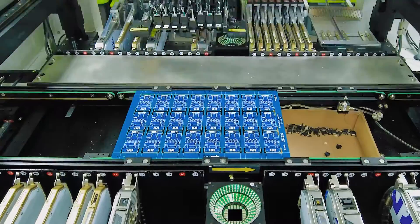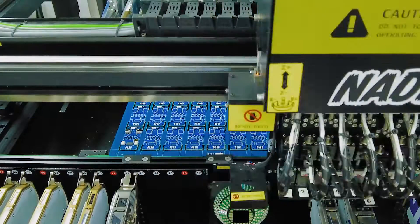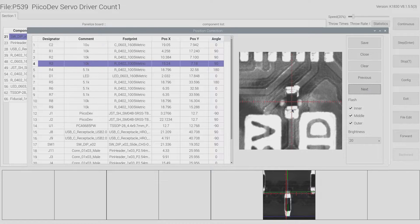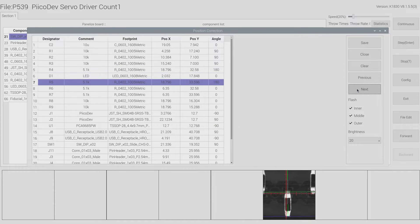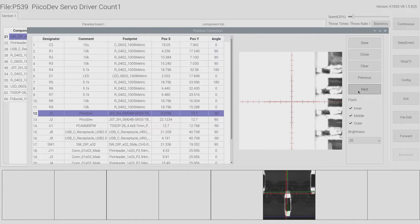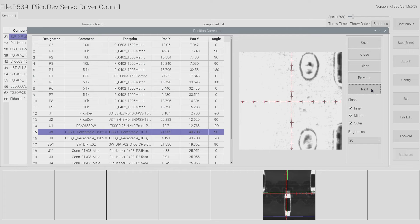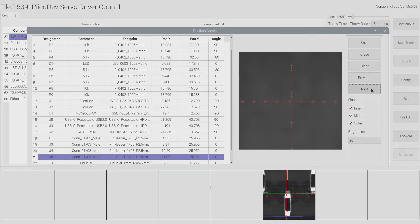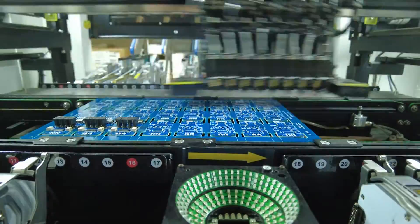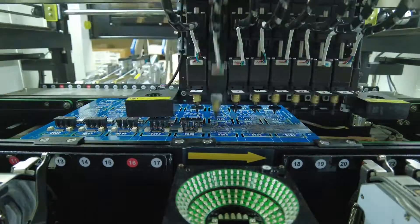Placing the first unit is always a milestone. Once placing that first unit is complete the machine will stop and give you the opportunity to make any minor corrections to the placements. You can step through with the down camera and look at every component placed to make minor XYZ corrections. Remember these are machines and these are tiny parts - little changes in temperature, stretching the belts, whatever. It's still an open loop system, so this correction step is really useful to dial in placement perfectly. With that complete we can finish up with the first panel - on this first panel I decided to just place the first row, bake it, and then test it to design-verify the whole process before committing the rest of the panels.